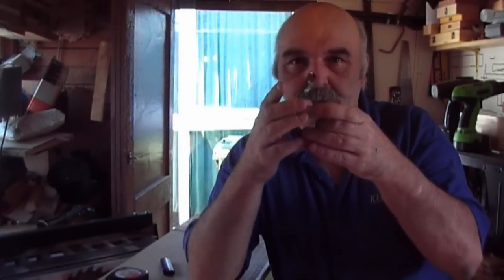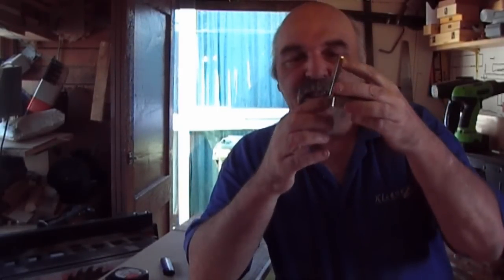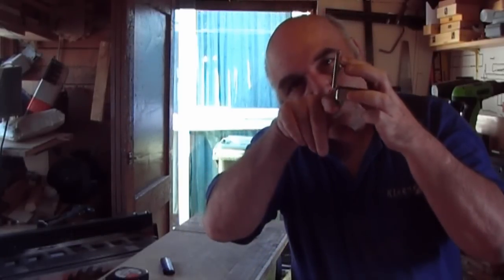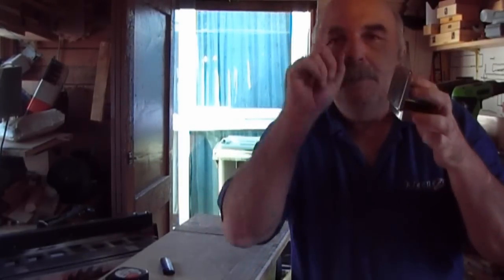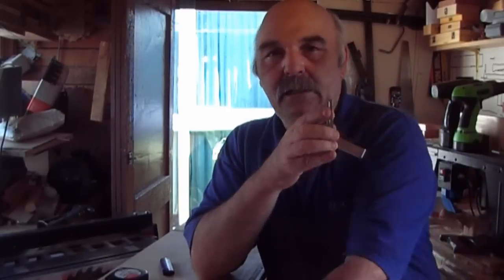how can I put it? The side, if this is the bottom sheet here, the side will come up, and 19mm, well, it'll be 7mm left on the outside edge that comes down on this piece here. But I'm not making a tongue out of that. I'm just going to square that up. Won't take much. Just a quick pass. That is then going to be the tongue.